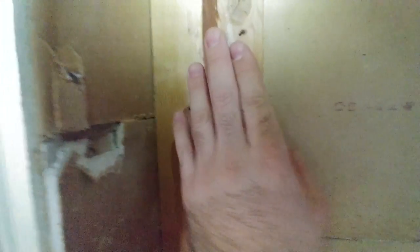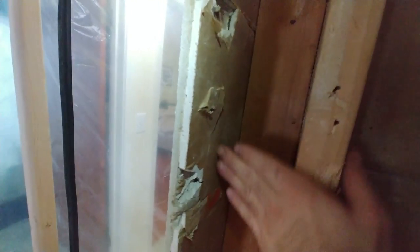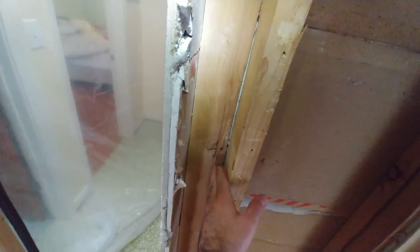Then I can come in with the saber saw and cut this board flush here. Whatever patch we end up using will carry over here — we'll just put a corner bead on, it'll get some mud, it'll become finished. So we're ready for install here.